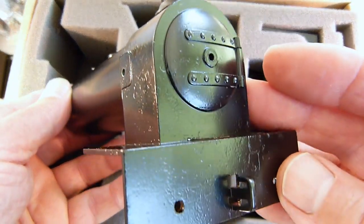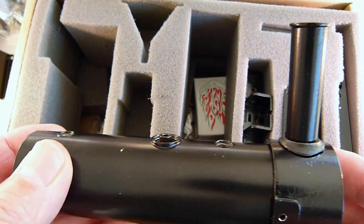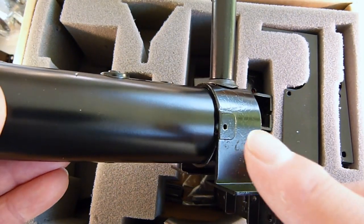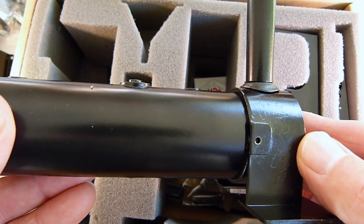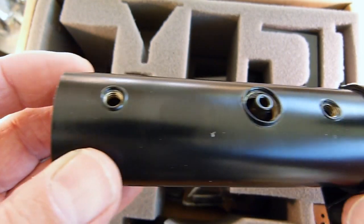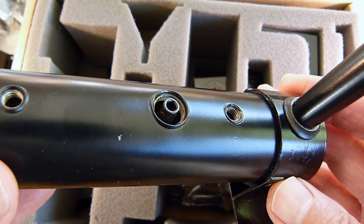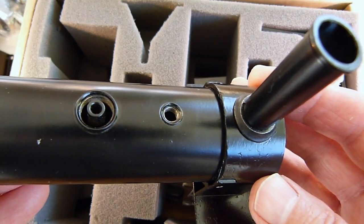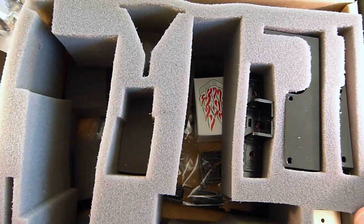The front of it is all assembled with the smoke box and the chimney, and of course the boiler, all attached together. There's no soldering here, there's no riveting. Put a screw in there each side and it's all fixed forever, although frankly it's a pretty tight interference fit on assembly. On the top of the boiler, that's where the whistle goes in. And that part is where the steam passes from the boiler on its way to the piston cylinder assembly below. And then finally, the last hole is for the safety valve that screws in there. Put that one aside also, because we're getting along nicely in showing you the parts.